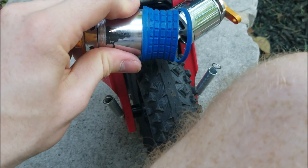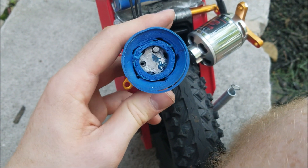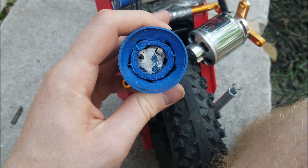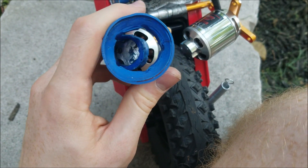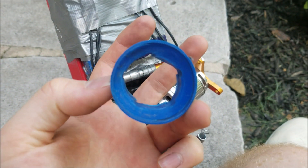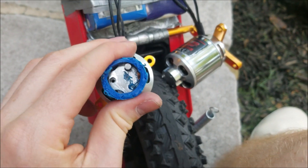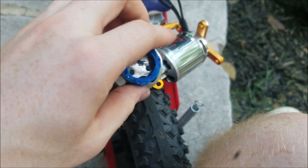Eventually the motors got pretty hot and the plastic started to melt. You can see my motor coupler piece kind of merged — those gaps between the metal and plastic used to be filled by plastic because it fit perfectly around that shape, but once it got hot it started to melt itself. So friction drive might not be the way to go, as tragic as that sounds. Thanks for watching! If you like my video and want to see more, don't forget to pound the subscribe button.